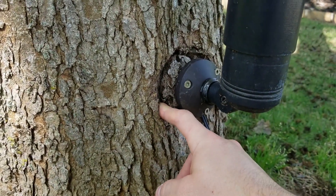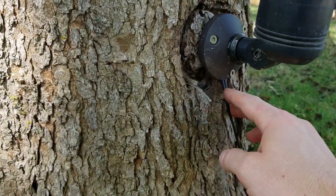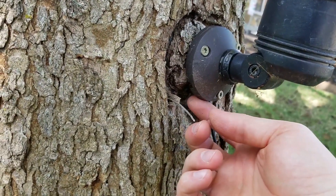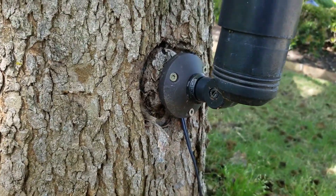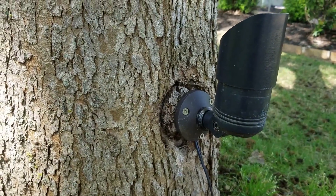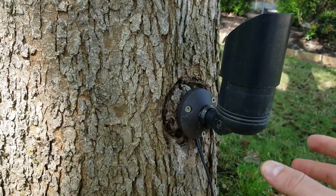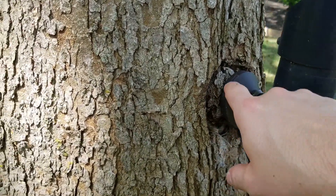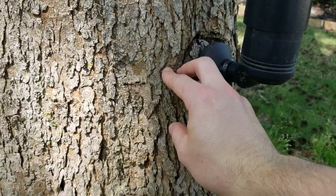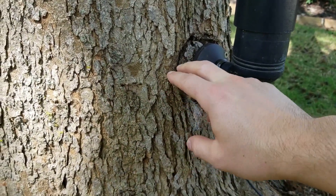The mount was essentially stuck inside the tree, but the light didn't work, and it actually triggered the whole system to go off because this wire down here was pinched against the tree and this mount right here — it was pinched so hard that it was causing the wires to touch. That happens quite a bit, so one thing you need to be mindful of is: if you ever put a mount on a light and put that light on a tree, make sure you have a bit of a gap so the mount stays away from the tree. You never want to put it right up against the tree, because it won't let the tree grow without affecting the light.